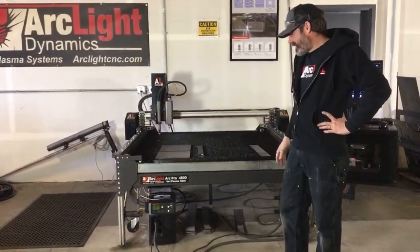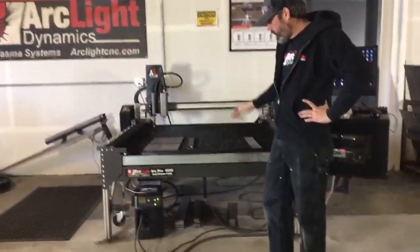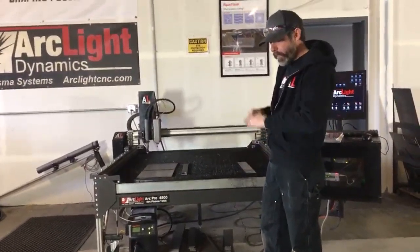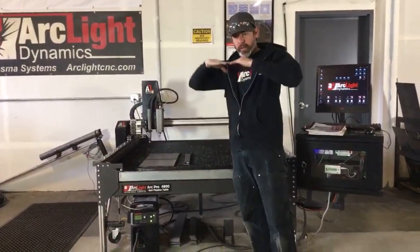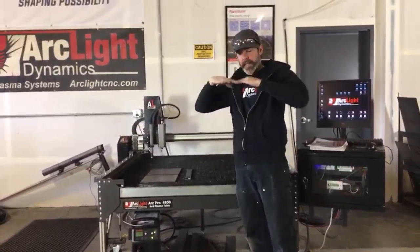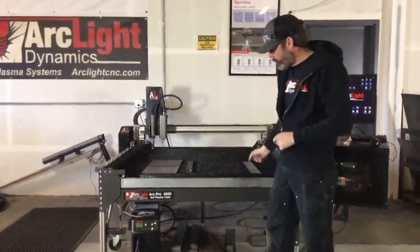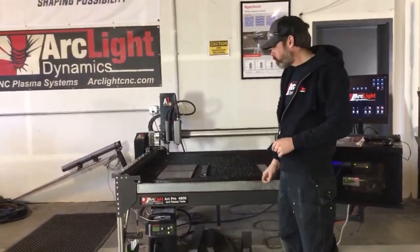Once the table is leveled and set in place, you take that center leg down just to give it a little bit of extra positive pressure. Don't give it too much pressure in the middle. You don't want it to curve up or anything like that. Just an extra 1/2 turn on that bottom foot should get you in the right spot.